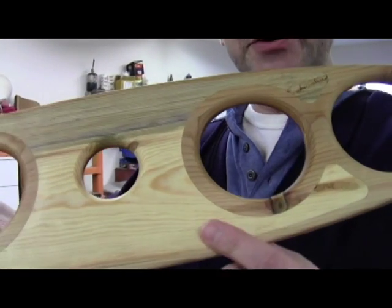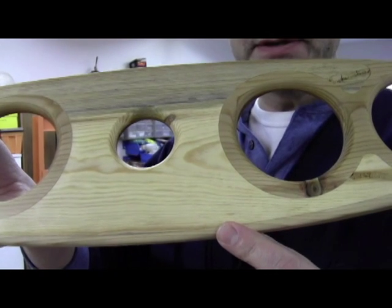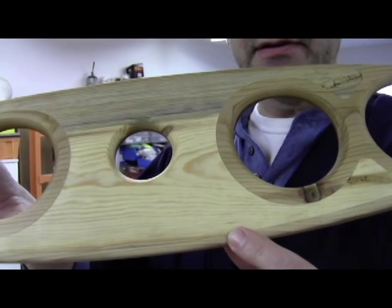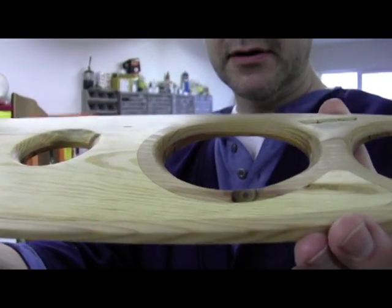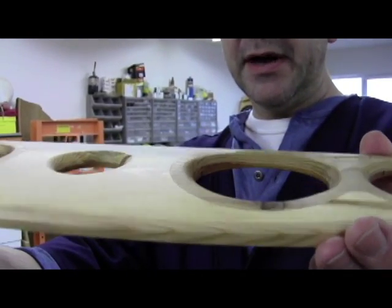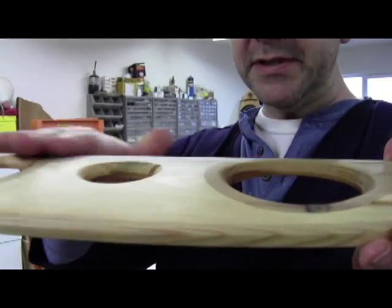To make this outline I used a CNC router. However, you can use a hand router with a template and make that inlay as you like. And realistically, if you look at the arc, you can see where I basically made it fit — I also used a CNC router for that, but you can easily do it with a sander and shape that.